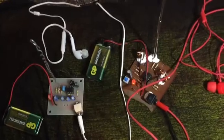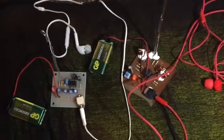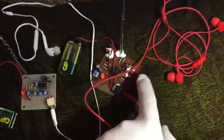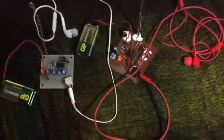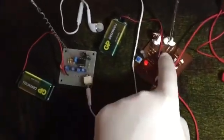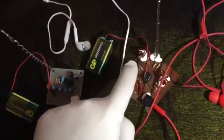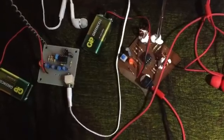When you bring this project close to any signal source — like Wi-Fi, mobile phone, X-ray, hospital machines, or any other device working with frequency — you can listen to the noise. We have two wide-range 10 microhenry coils, and these two coils will pick up those signals, which get amplified by the IC. We can hear the output through the stereo phone jack, and it works very well. I have some silicone glue here to fix the coils; you can also use normal glue.